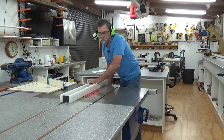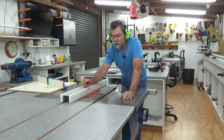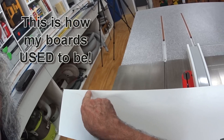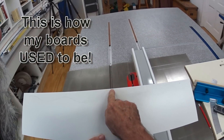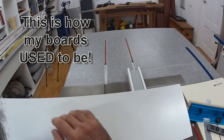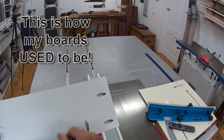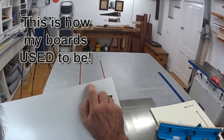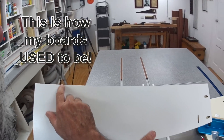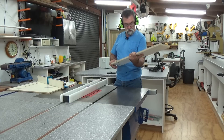I have the riving knife on behind as well. It's very important to use your riving knife whenever you can. Have a look — you'll see this edge all the way along here is absolutely beautifully clean. That's the top. When I turn it over, this is the underside — you can see a little bit of chip out. You will be familiar with that. That will be all the way along. So we're going to do this so that we have absolutely no chip out at all.